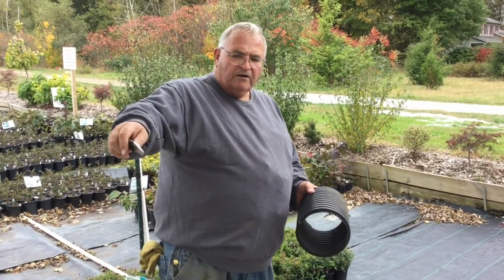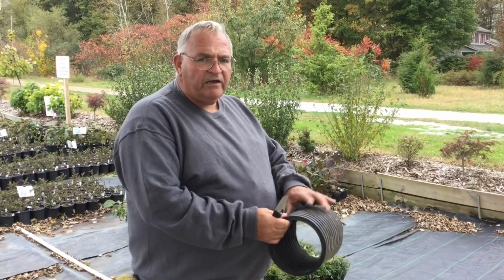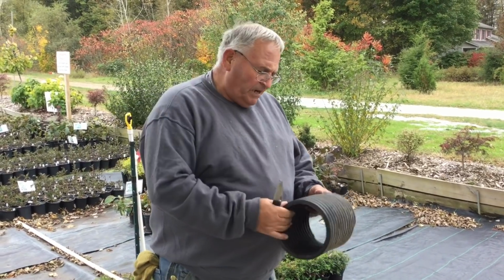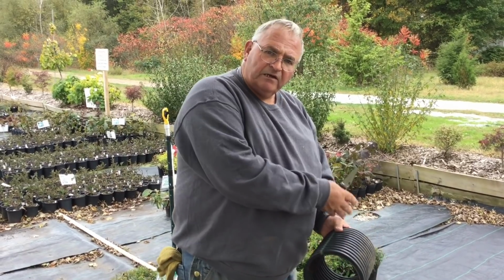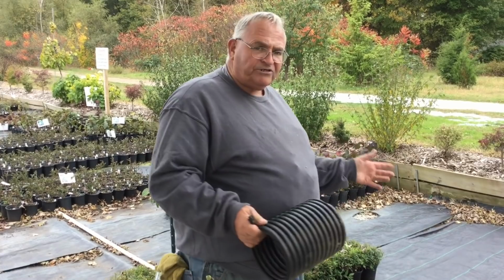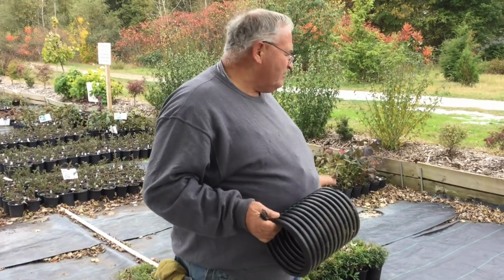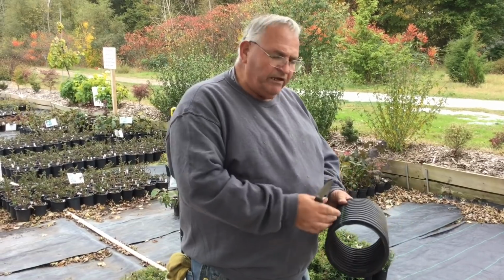Then over there, the magic of perforated pipe is that instead of the holes letting the water in, over there they're letting the water out. So in the trench over there, especially near the end, I went deeper and I put more stone. I probably put 24 inches of stone, and then the pipe, and then stone on top of that. And it works pretty well. It's not really fast because it's a seeping type action, but I never have a problem with standing water in this area for very long at all. So it's a good way to get rid of it.